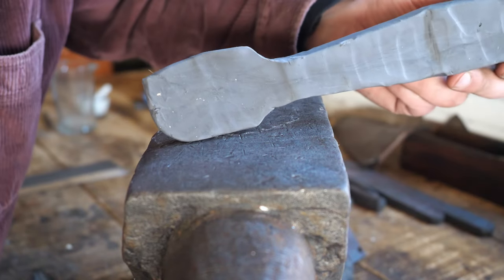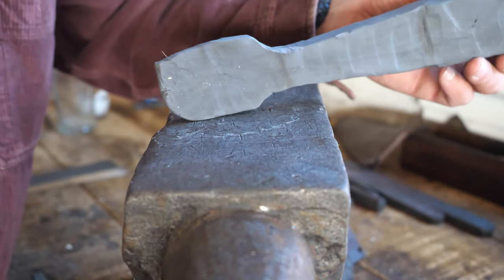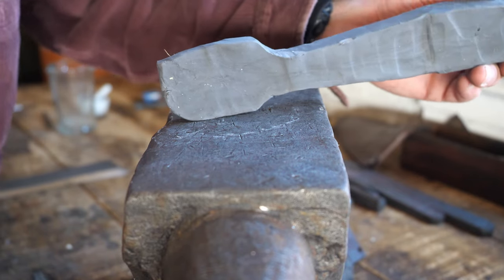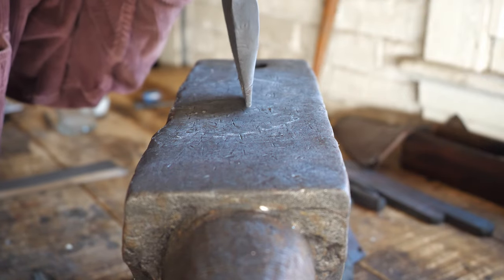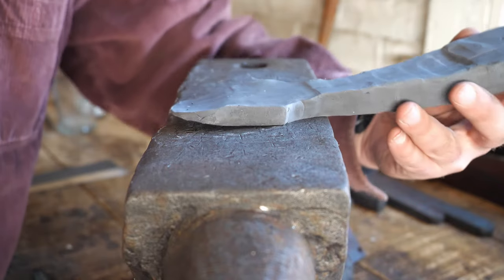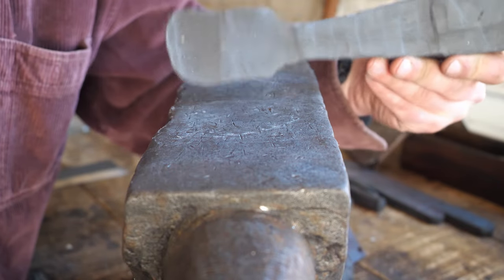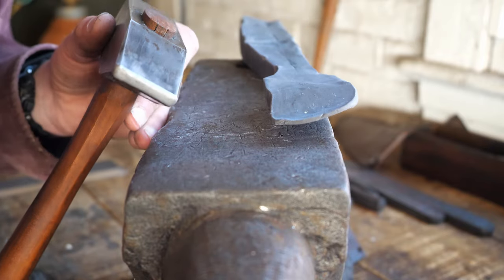At this point in the video, you see me have something like this as a preform. In order to forge as closely to finish as possible, which I always try to do in my work, I put a simple chisel taper. You can see that, right? So putting this simple chisel taper makes spreading the spoon bowl a lot easier. Let me zoom out. This is ridiculous.